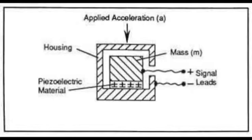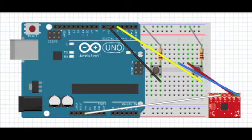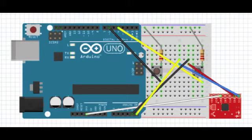readings. I then connected 2 wires from the SDA and SCL pins on my accelerometer to the center of my breadboard. Next I put 2 wires which I wired to pins A4 and A5 on the bottom header. Pins A4 and A5 are what allow you to communicate with I2C and TWI pins. In simpler terms, this is where the accelerometer and gyroscope output their serial data to be received by the Arduino Uno and manipulated by the code.